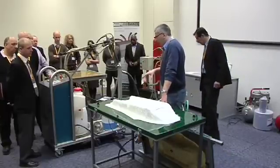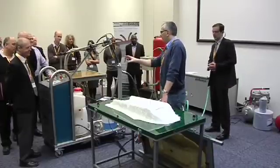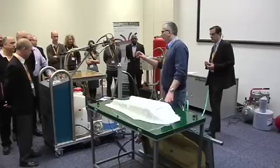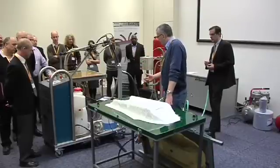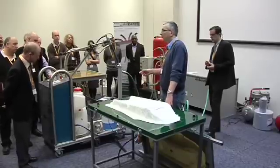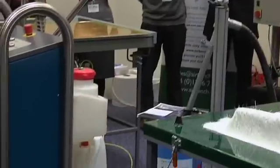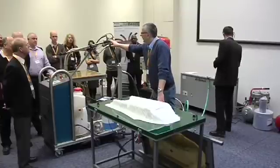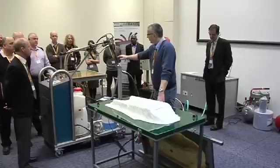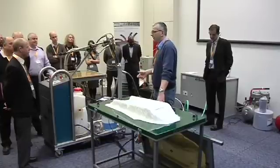We're going to close the tool up now. The whole aim of this process is to be a closed mold, clean production-based process. What the machine does is take resin from store — in this case we've just got a 25 kilo keg on the back — and catalyst from its store, which is a standard 25 kilo catalyst container, and it mixes the two components in the correct ratio. It pumps them around the system up to a mix head, and when the appropriate time comes, injects into the mold mixed in a static shear mixer, and as they go into the mold we control the flow rate and the pressure.